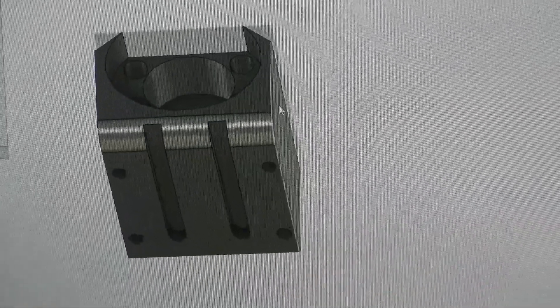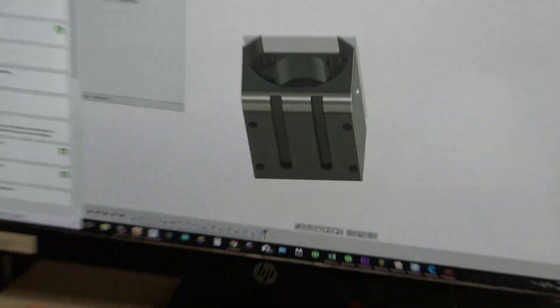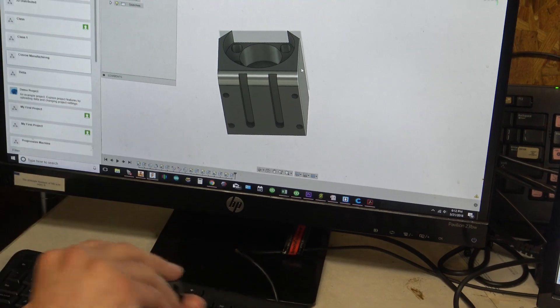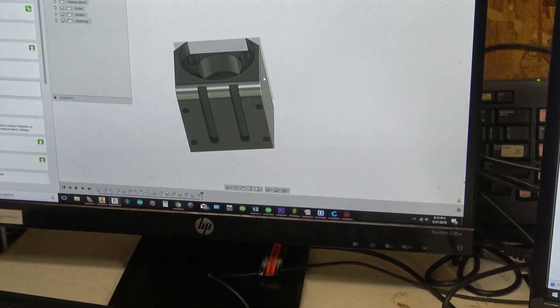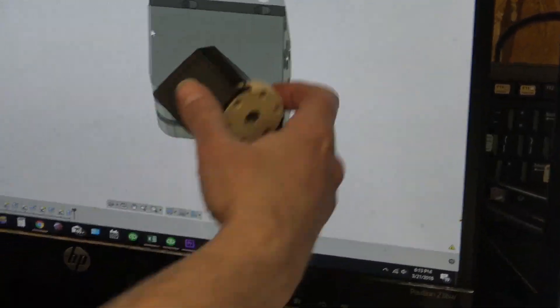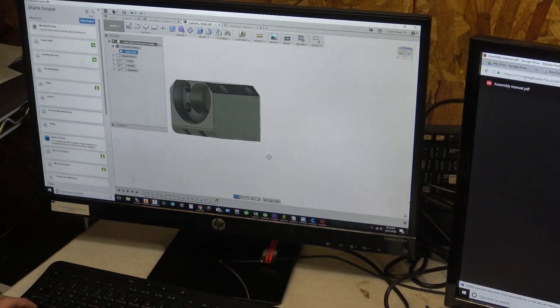This is what it's going to look like. There's a hole pattern underneath here for cap screws. I was going to put counterbores there for clearance, but I decided to put slots instead so we wouldn't have to disassemble it to take it off — we can just loosen it up and slide it off. That gives us two methods of disassembling the Y-axis. The new one will actually slide into the back of the Y-axis lead screw carriage mount.